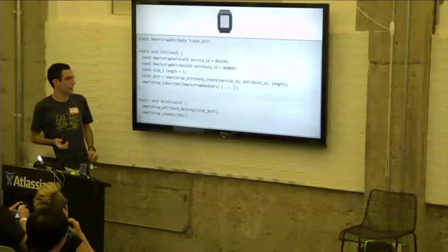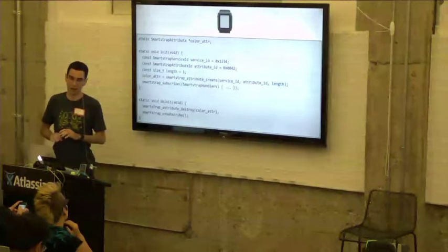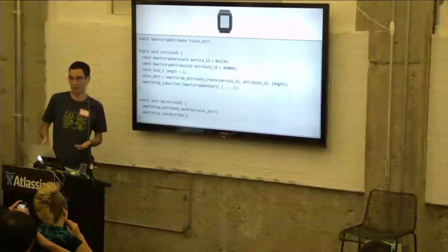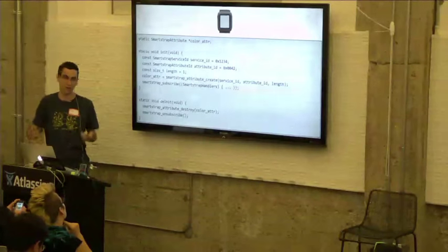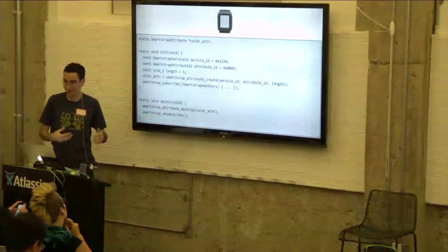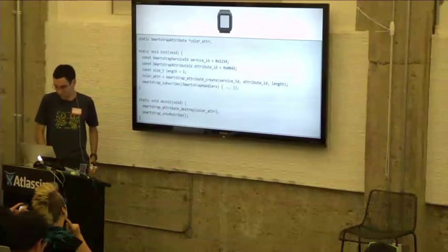And then lastly, in the init, I'm calling Smartstrap subscribe. I'm going to get to a little bit later what the actual handlers are that we subscribe. But these are going to be things like callbacks when we get requests from the Smartstraps and when services become available. In the deinit, we do pretty standard stuff, just clean up what we use, clean up the attribute that we created, and unsubscribe the handlers.